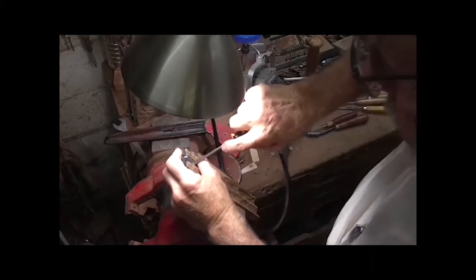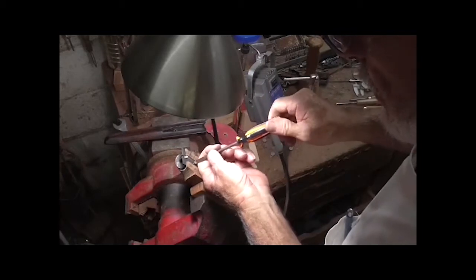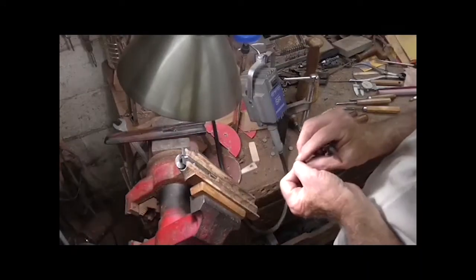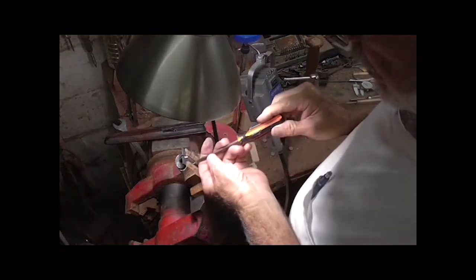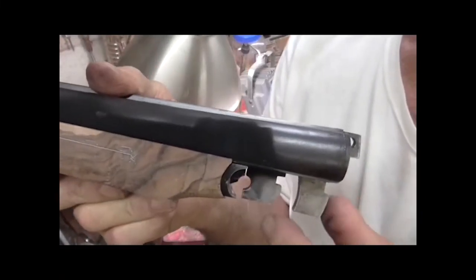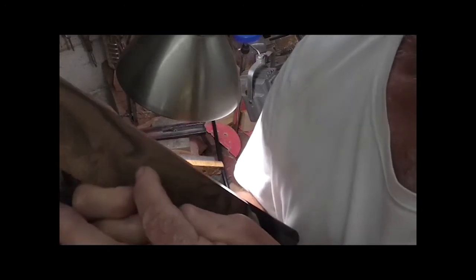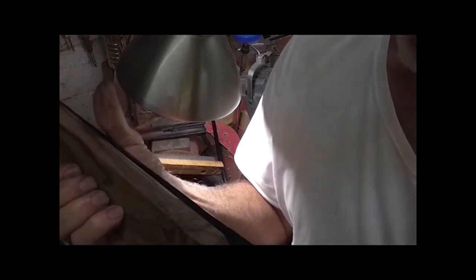Not tight yet. I think I'm going to take it out, put a little drop of wax on the threads, and run it back in there. I don't want to break that thing off in there — I've done that before and I don't really like it. But if you've got a tight thread, put just a little drop of paraffin wax on it, run it in one time and back out, put some more wax on it, and it'll slide in there a lot easier the second time. Then the metal is in contact with where it goes. It looks like it fits well enough — I'm ready to put the bottom metal and the release lever on, I think. It shouldn't need much more than just a little tiny bit of tweaking.